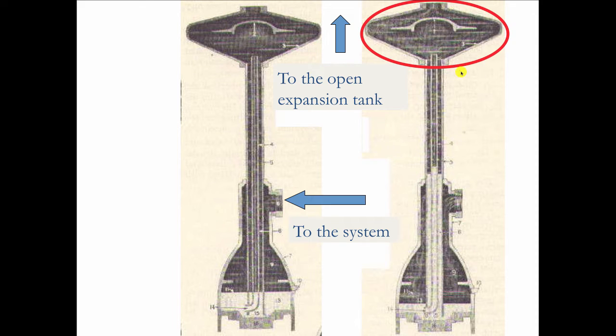So Honeywell now gives us a system that could work with one pipe to the radiators. It could work with much smaller radiators because his hot water is 250 degrees. It could work with much smaller pipes because the hotter water is going to move a lot faster without benefit of a circulator. And that's why they called it the heat generator. And upon this rock, he built his church. This was a device that put Honeywell on the map nationwide, the Honeywell heat generator.